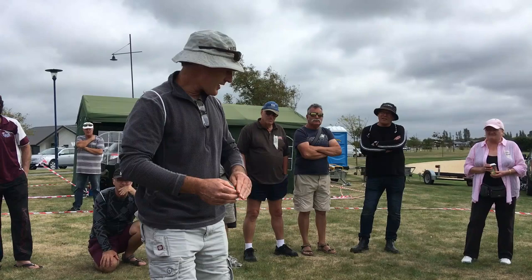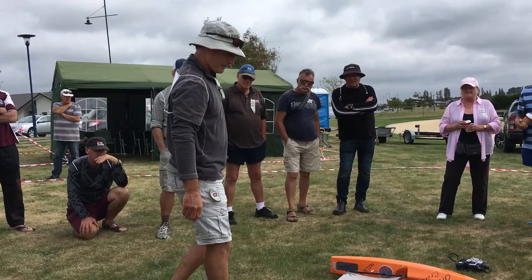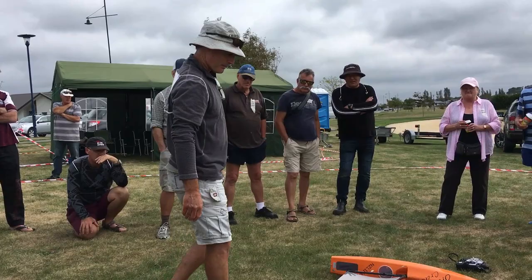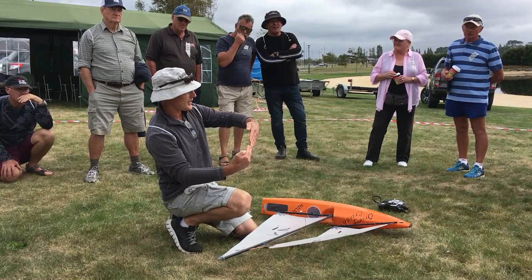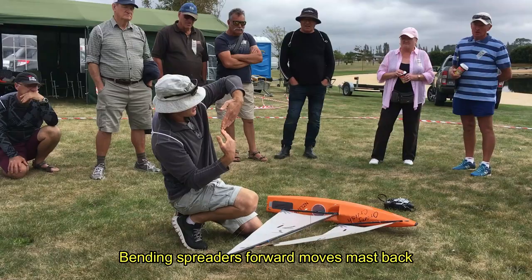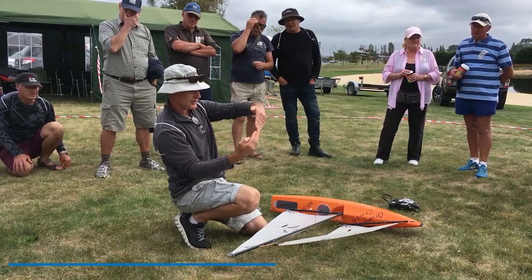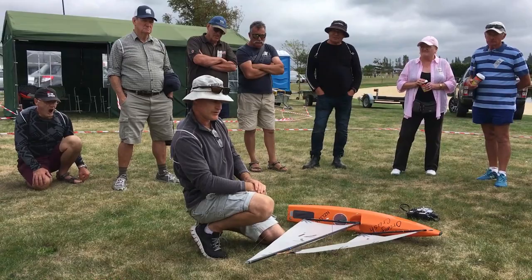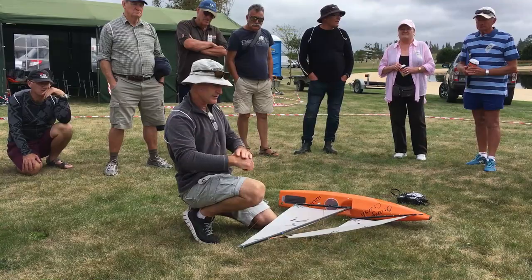You want your mast set up with a fairly straight profile — maybe a slight bend — but you also want something that gives you a bit of pre-tension and rigidity in the whole framework. That's where your mast gate and spreader angle come into play. If I crank my spreaders back, it pumps the mast forward in the middle. If I invert them, it brings the mast back — but you'd probably get a reverse bend locally, which is no good. You need to end up with a uniform kind of bend. It's important to get your spreaders about right and your mast ram about right. The mast ram is really important for your whole rig foundation — it's got to be coming out of the boat nicely to give you a fairly rigid setup.